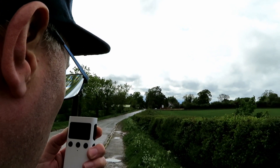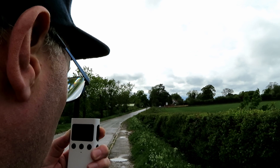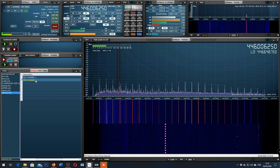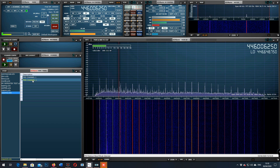Testing the new Xiaomi at location A on PMR channel 1. The quick brown fox jumped over the lazy dog. Unfortunately, as you can see on the SDR, there was lots of local interference — and there has been for a while locally on the PMR bands. I'd also got the SDR set into wideband mode, so when I was remotely trying to make this recording, it didn't work properly. So I've gone just for the FRS SDR recordings, which is a fairly good representation of what you're going to see on PMR anyway. It definitely works fine on PMR, because I've already tested it on those frequencies.